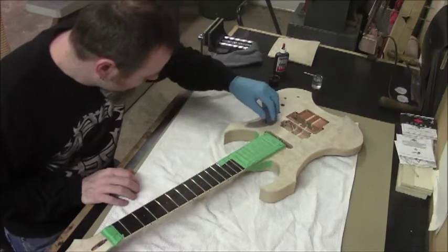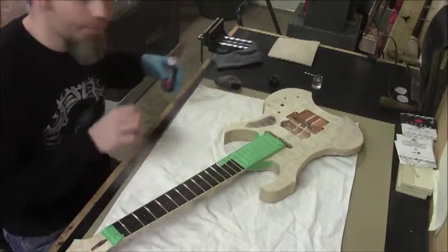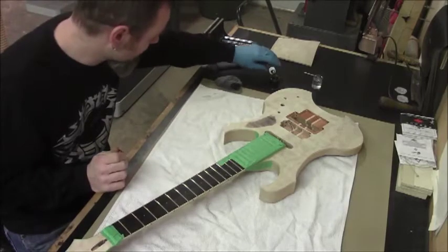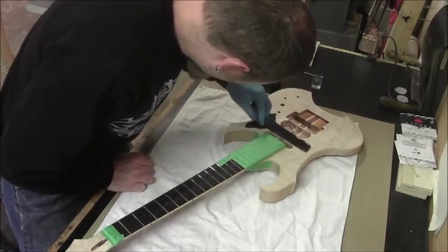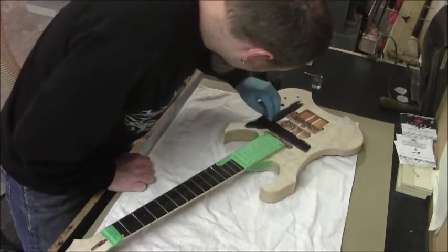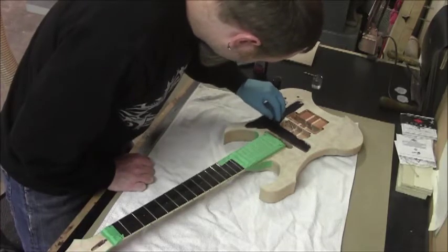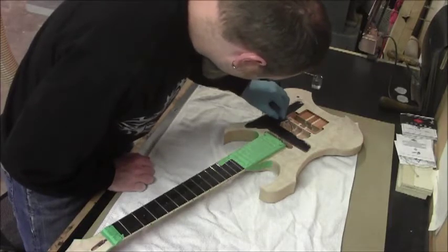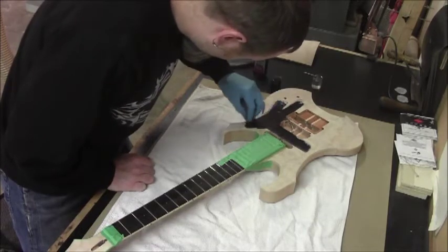Kind of just work this around — looks like I might have to add a little more stain. It doesn't quite look as dark as I want it. The beauty of this stuff is I can just keep adding more if it's not dark enough. You just want to work this around, sticking to the areas along the inside. It's getting pretty dark, and with this really dark stain, when we sand it back we may only have to do one application. Sometimes I won't do it as strong as this and I'll do a few applications.